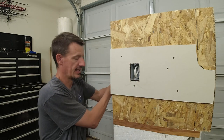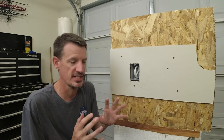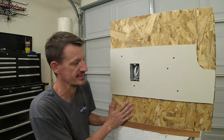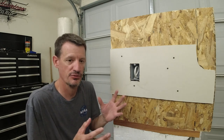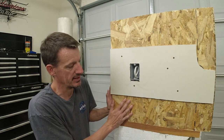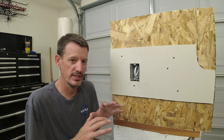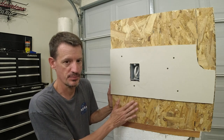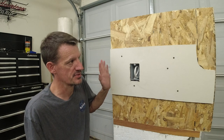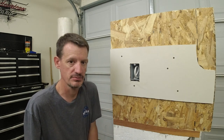You've got a sheet on the inside and the outside, and the foam core holds it all together solid. You actually end up with twice as much load-bearing surface compared to standard stick framing in that two-foot section. The industry does a really poor job of demonstrating how strong these things are. You'll see a lot of timber frame houses using SIPS panels as exterior walls, but you don't actually need the timber frame — these SIPS panels are perfectly capable of supporting the roof on their own.